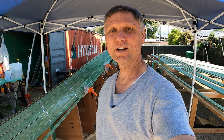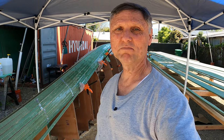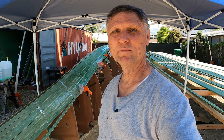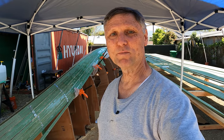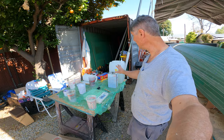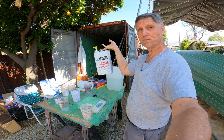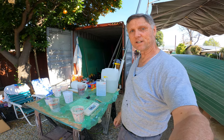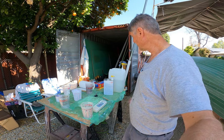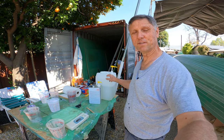It's Saturday and we're hard at work epoxying strips in as we go down. It's slow work — it takes about 45 minutes per strip minimum, up to an hour. We're getting better at pre-measuring things. This is our prep area where we're using West System Epoxy, right now with the Fast Hardener, though we may switch to Slow Hardener soon because it's 88 degrees today, which limits our working time. We have this in a four-gallon jug but have a 53-gallon drum.